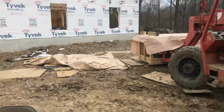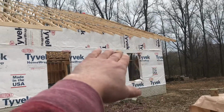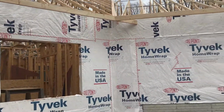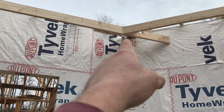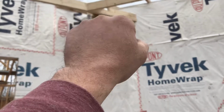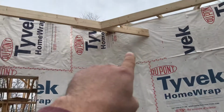But anyways, this is what we basically got done today. It's a Sunday, and it's pretty good for a Sunday, but we got the strip of OSB put in here. We ran out of Tyvek tape, and that kind of stinks, but we're going to be going up there anyways a couple more times. But with these 45s, when they come in, I found this is the strongest way. You don't want to break it at a 45 miter right there. We run this fascia all the way to there with a 45 bevel cut. You put a backer on the other side of the OSB and shoot 3 nails through it. We didn't shoot those nails there yet because we didn't go inside and put the backer. So once we put the backer through there, nail that in there, and then these tails, it helps support. It's all supported in there really good.